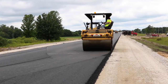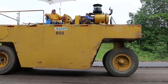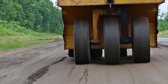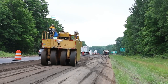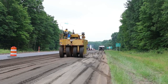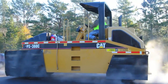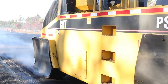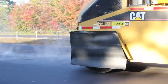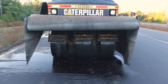Rollers must meet the following requirements. Pneumatic tire rollers must be self-propelled and are equipped with a minimum of seven wheels situated on the axles such that the rear group of tires will not follow the tracks of the forward group, but are spaced to provide a minimum tire path overlap of one-half inch. The tires are smooth and capable of being inflated to the pressure recommended by the roller's manufacturer. Pneumatic rollers leave the top course pavement free of excessive globules of mixture after rolling, and are equipped with a mechanism capable of reversing motion smoothly, along with wheel scrapers and skirting to enclose the wheel area within three inches of the pavement surface.